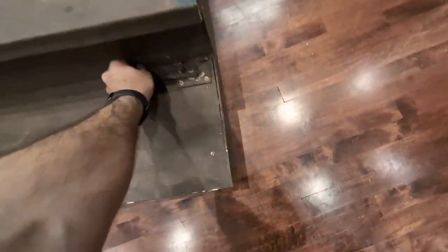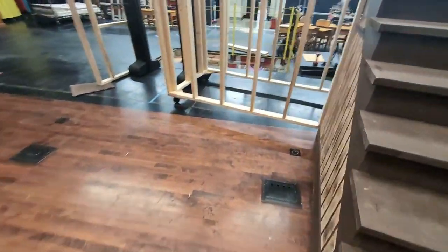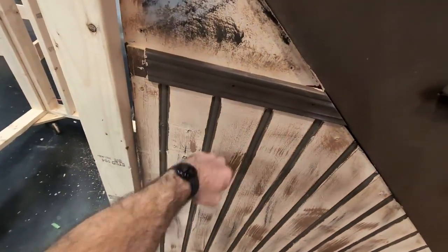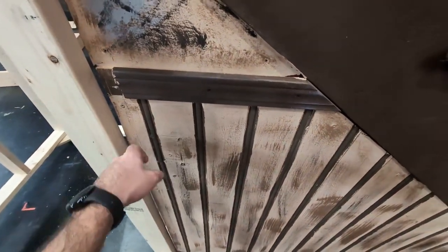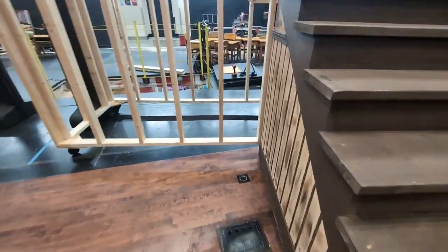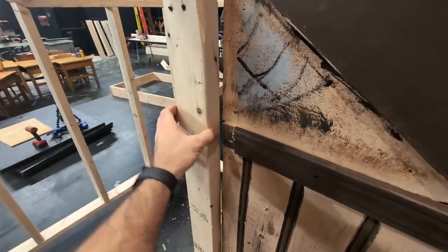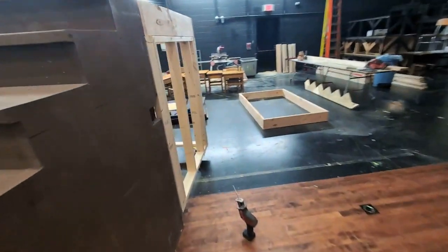When you locked them together, you used these pole barn door latches. Same as over here, we must have had the pole barn door latch hook, which is going to work out nice because we've got a stick right there, which is where we're going to want to mount the little loop that it grabs. In fact, I'll probably end up with a 2x4 like this as well. So we have a really nice, well-fortified, against rotational forces and stuff, situation there structurally.